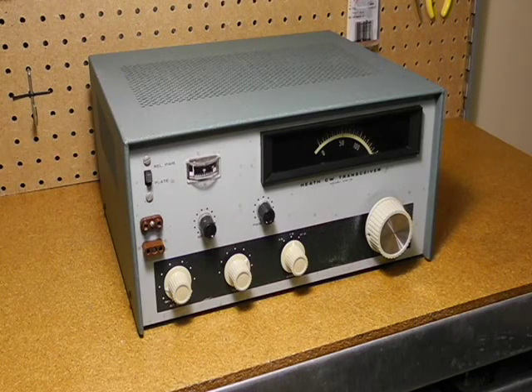The transmitter section can optionally use the separate Heathkit HG10 VFO instead of a crystal. It has speaker and headphone jacks, though there's no built-in speaker. The Heathkit HS24 was the recommended matching speaker. It has a built-in 120 volt AC power supply. Testing and aligning the kit only required a vacuum tube voltmeter, dummy load, and crystals.